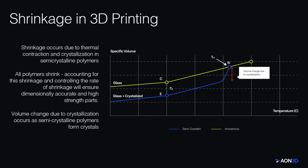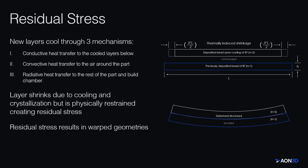Let's discuss what residual stress is and how we can reduce it when printing high-temperature thermoplastics. Heat is brought into a 3D-printed part continuously from the top surface due to the layer-by-layer process. Layers below the newly deposited track will cool relative to the extrusion temperature, and heat will transfer from the top layer via conductive heat transfer to the cooled layers below, convective heat transfer to the air around the part, and radiative heat transfer to the rest of the part and build chamber. As heat is lost rapidly from the top layer, the layer begins to shrink, but since it is constrained by the previous layers beneath, it is not able to shrink or deform significantly. Residual stress is created when a material has the propensity to shrink but is physically restricted. If you were to remove this part from the build plate, you would immediately notice that the edges curl, because the part is no longer constrained and is free to deform, relaxing the residual stress.